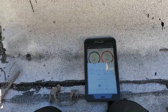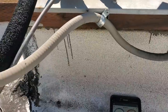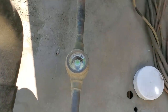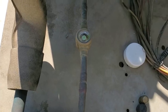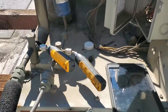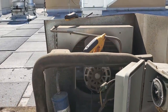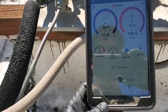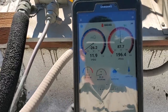The system is turning on and off and everything seems to be okay. Let's let the system operate for a little bit. As the system has been running, the sight glass is slowly starting to flash every once in a while, but it's intermittent. My system just satisfied at 34 degrees and it looks like it's coming on right at 40 degrees. I noticed it was a rather short cycle time, so I'd imagine the system is probably a little oversized by the way it pulled down real quick.